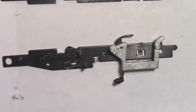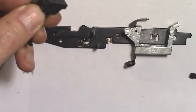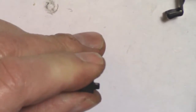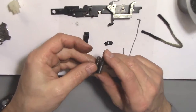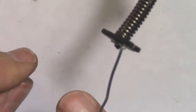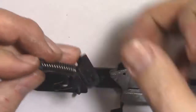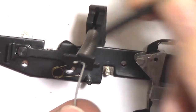The magazine well and feed ramp go back. You can use an old pipe cleaner to clean out the hole for the hammer. Lay the hammer spring on the table with the notch to the upper left. Push it in to remove the paper clip, then hold it down and remove the spring. This is the kit spring — it's slightly longer. Reinsert it and put your paper clip back in. Paint grease into the slot milled into the face of the hammer — you can use automotive or gun grease. Apply it to the post as well, then drop it in place. Note the notch is to the upper left; it allows room for the disconnector bar to move back and forth.